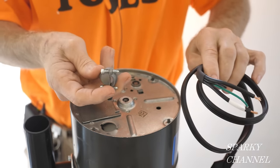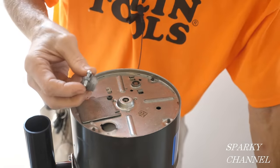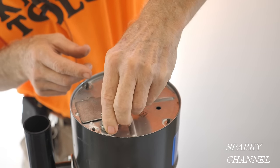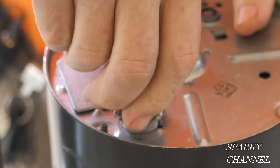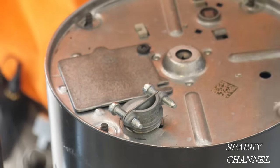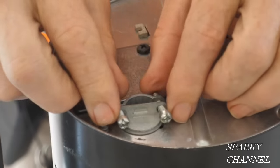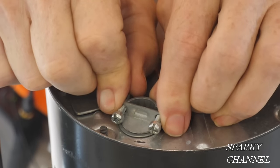You can see that the neutral has a slight texture or striping to it and the hot is smooth. I've color-coded the neutral wire with white electrician's tape. If you buy this cord, they give you one of these cable connectors and that's the kind you need. Put it in the hole and go counterclockwise — you hear that click? — then go clockwise and tighten it all the way good and tight.